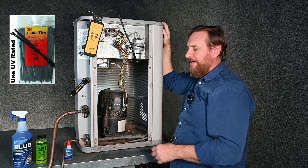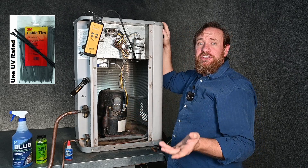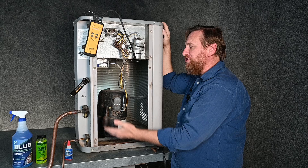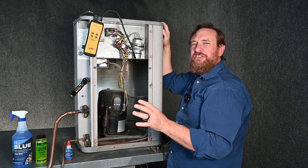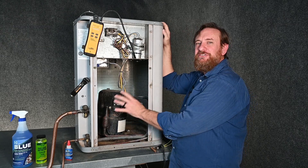I can't tell you how many leaks I've found from wiring touching and putting holes in copper piping. On the other scenario, you can have situations where it actually eats the hole through the insulation and causes a short — either a low-voltage short or a high-voltage short. I see lots of people looking for shorts and they can't find them, and it's simply a low-voltage short — maybe the weather has to be just right, just the right amount of humidity, and it starts shorting out. So those are some key things to look for.